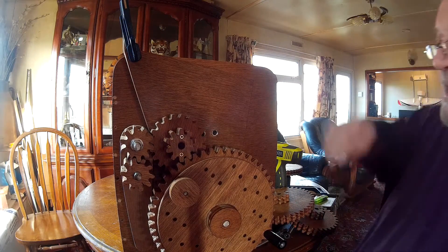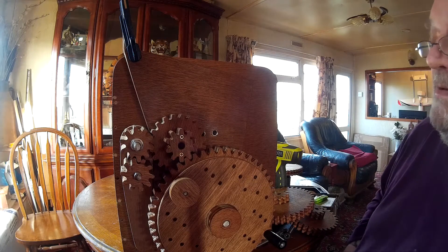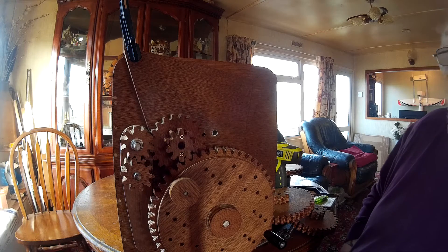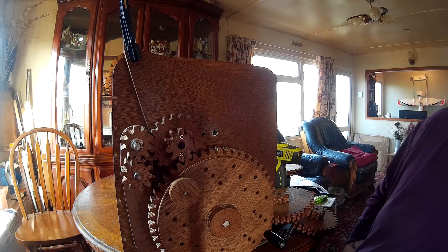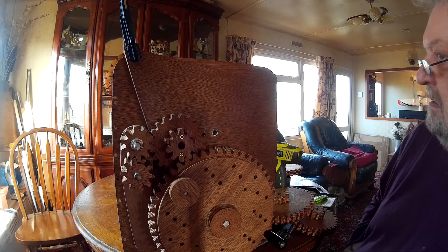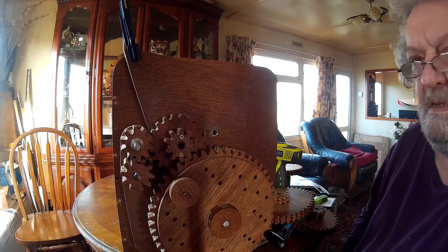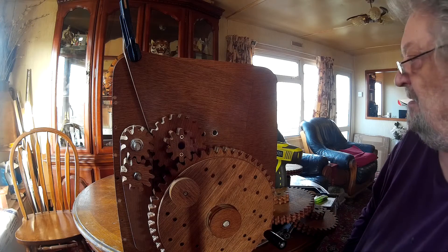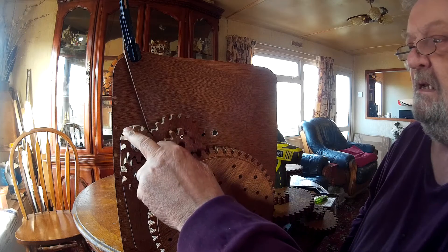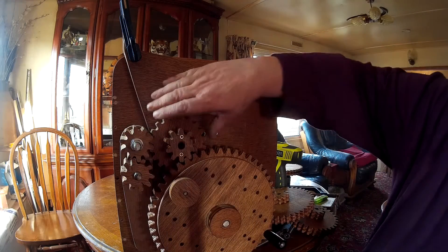Now then — that's fine, that's for the lower set of gearing. That will go up to, I think, 100mm pitch which — unless I'm very mistaken — is... do you know, the ratio has escaped me. 100mm pitch, that's a 4mm lead screw, so it must be 25 to 1 reduction.